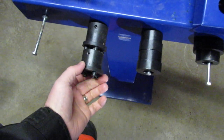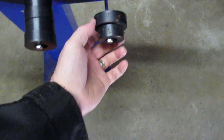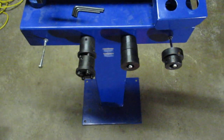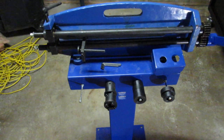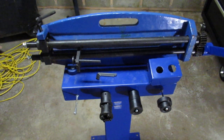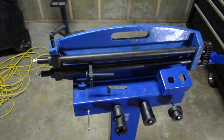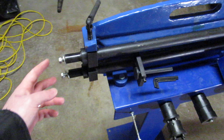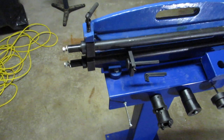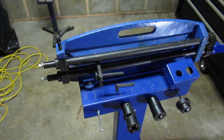I don't know if these dies are hardened steel or not. I should have sprayed them with some grease — some of them are showing a bit of corrosion, so I'm going to have to polish them up and oil them. I'm probably going to get some additional dies. What I need to do is build some inside fender wells, so it would be handy to have some rollover dies. Covell sells them, and Eastwood sells them as well — Eastwood also sells tipping dies and polyurethane dies. The Covell dies are meant for Pexto and Mittler Bros bead rollers so they probably won't fit on this one, so I'll probably just stick with Eastwood.